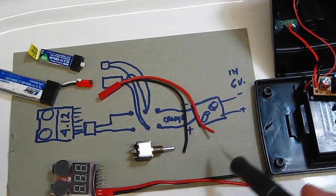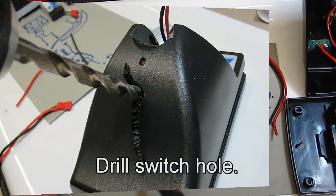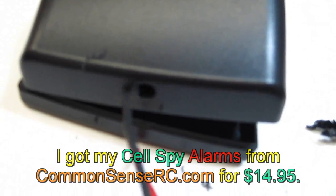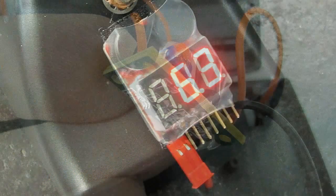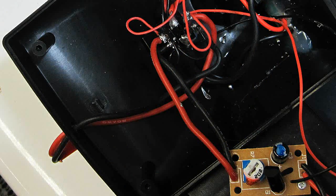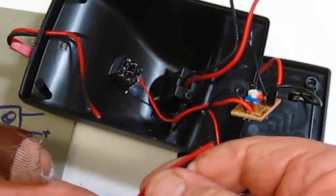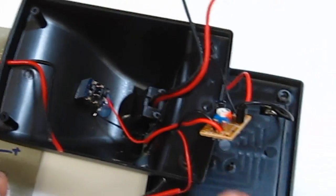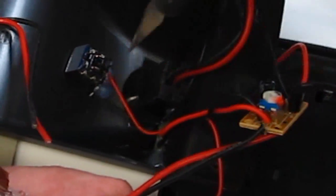I'm going to remove these wires, connect the center tap of the switch, and then connect either side of this so we can set it up — I'll show you. Here's the schematic of what it looks like. I've drilled the first hole for the switch and the second hole for the wires that are going to go in for the CellSpy. I got my CellSpy alarms from CommonSenseRC.com for $14.95 each. I know there are cheaper ones without alarms, which is okay because they're not needed in this case anyway. Just make sure they can read single cells. Then I mounted velcro on the back so I can mount this right here. Okay, we've got the switch mounted, the wires for the battery up front and to the CellSpy in the back. What we have to do now is simply remove these two wires, and with a couple of short wires, we're going to solder those back in and then solder that to the switch.